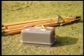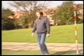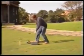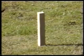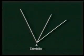The first stage is to set up the tripod over the point from which the angles are measured. In this case, the point or station is marked by a nail which has been driven into the top of a wooden peg. This instrument station will be designated station A. There will be three other stations which will be designated stations X, Y and Z.